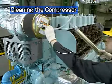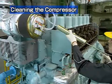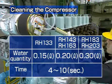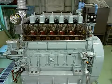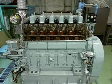Pour water into the turbocharger while running the engine at a high load, waiting more than 10 minutes between each pouring. It is inadvisable to pour in water more than three to four times. Run the engine for more than one hour after pouring in water in order to dry the compressor.